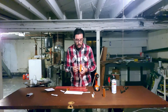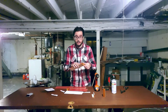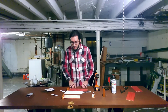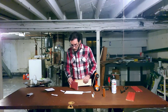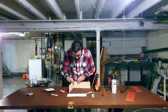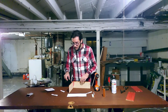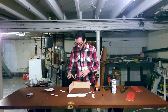It's not been the full 15 minutes because I'm impatient and I took it off. It says four minutes of holding it together, so it should be good — it feels pretty solid. I'm going to get some more epoxy and try another corner. I think the best course of action is to do an opposing longer corner to get as many pieces going as possible. I'll put on the clamps, leave them on for about 8 minutes, then move them to another piece. You'll probably watch that in a time lapse or something.